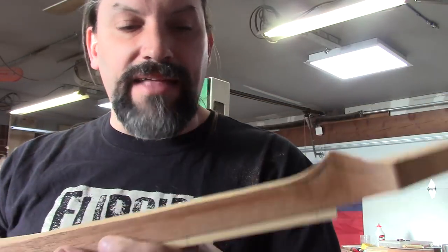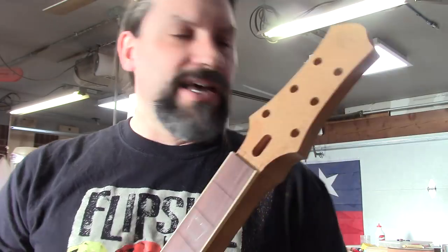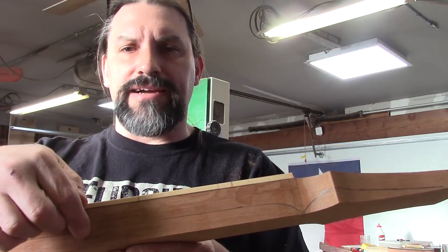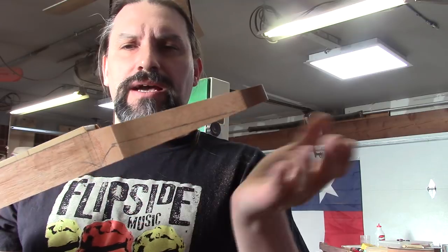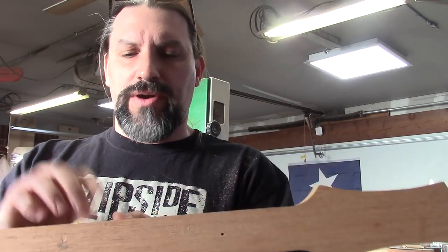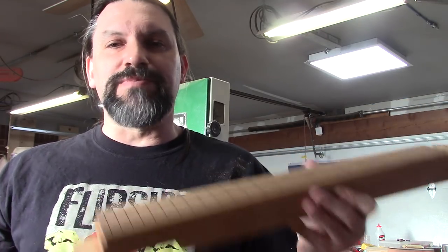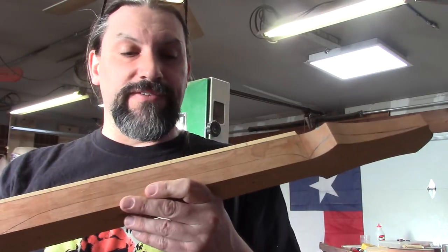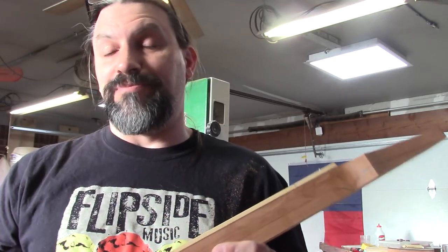This one has already gotten the treatment and there are no screw holes. You can also check out the inlay on this one — this is the very first Challenger with trapezoid inlays. All my necks are marked: I've gone about an inch and an eighth from the edge of the binding to the back, and five-eighths on the headstock. We're going to hack away material, sand the back of the headstocks on the old man machine, and shape the neck contours on the pin router and deadhead sander. Enough talk — let's fire up the bandsaw and start making sawdust.